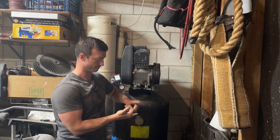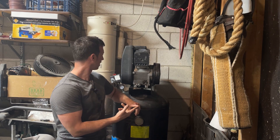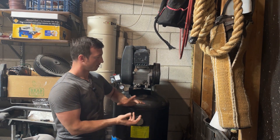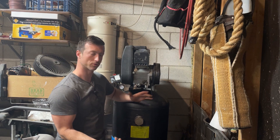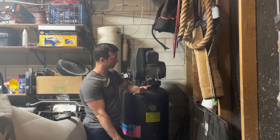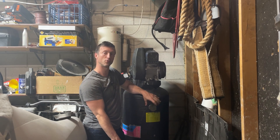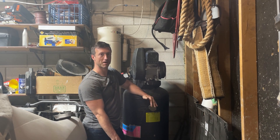Done all the maintenance — we've drained the fluids and changed the oil, put an air filter in because there wasn't one, checked the belt, drained the water from the tank, and checked the pressure relief valve. That's about it. We're going to run it now and let it build up to its max PSI of about 125 PSI for the tank and see how it goes. There you have it — that's the video on air compressor maintenance. I'm not an expert by any means, so if you have anything to contribute, leave it in the comments below.